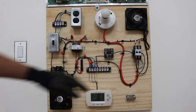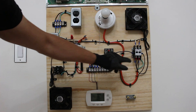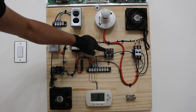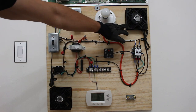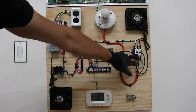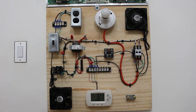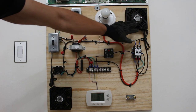Here is a contactor — specifically a two-pole contactor with a 24 volt coil. In between you can see we have a timer — just a time delay. Up in the top right corner, this is a representation of our condenser fan motor. This light bulb is a representation of our compressor, and this contactor is the starting component for our condensing unit. A condensing unit consists of a compressor, a condenser coil, and a condenser fan.